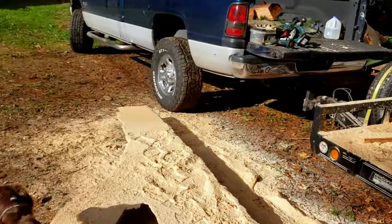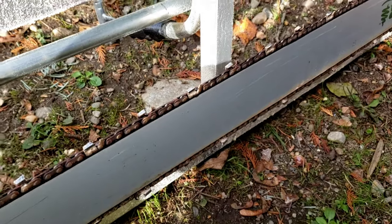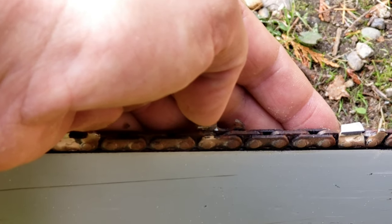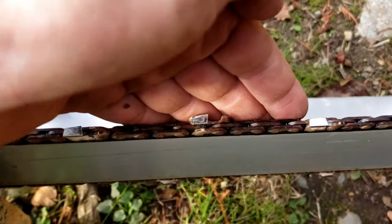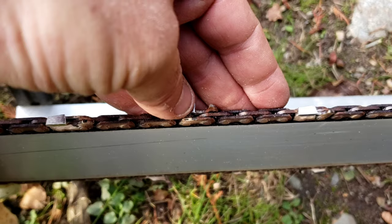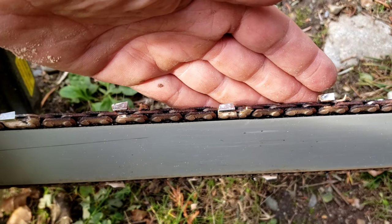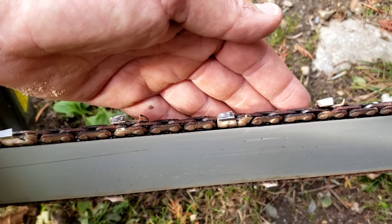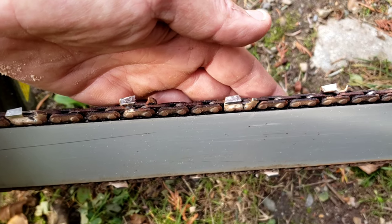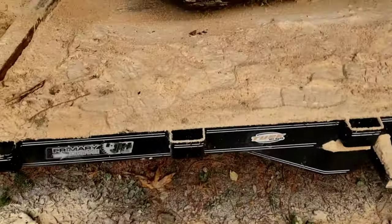A lot of what goes into having a smooth cut has to do with chain filing. We get cuts consistent with bandsaw blades, honestly. This is a full-chisel normal chain that we filed back to 5 degrees on the top plate — instead of the normal 25 degrees, we filed it back to 5. It's a full-chisel skip-tooth chain. We've always run full-comp milling chain which is semi-chisel and round-ground. I thought this full-chisel skip-tooth would produce a super choppy, rough cut, but it doesn't.